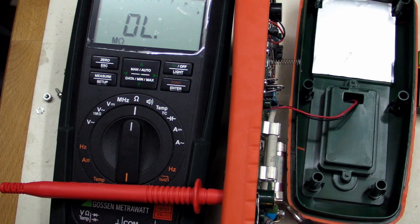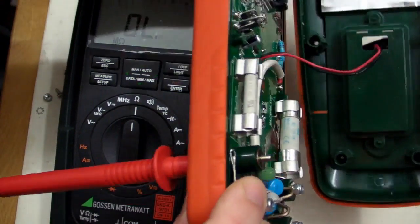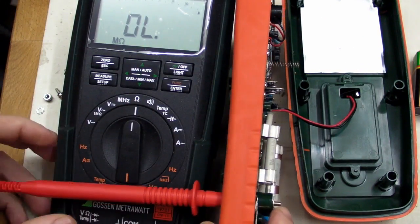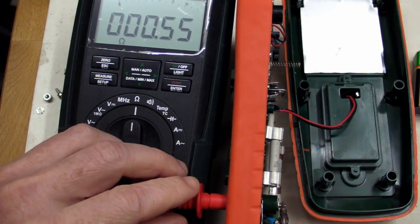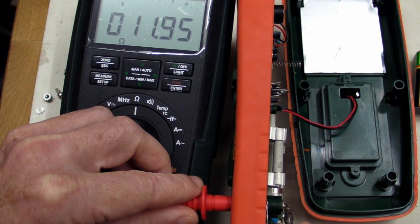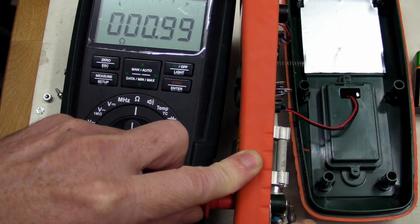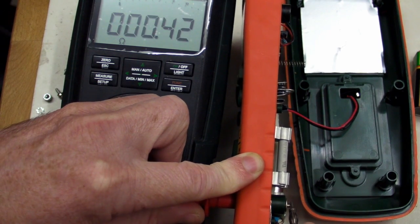Now, I've taken off the lock nut and the star washer, so it's got this screw thread coming through at the bottom here, as you can see, like that. And this is a very tight fit, this input probe here, and we'll probe this. So it's making good contact in there, I have no doubt, and not a problem. But if I start to wiggle this red probe a bit, it really does jump around quite a bit. So there's something going on inside that input jack.